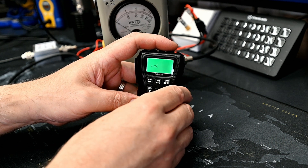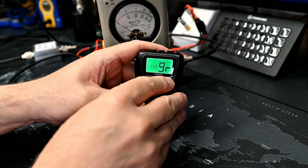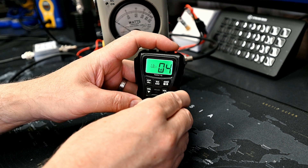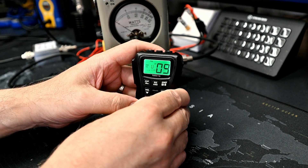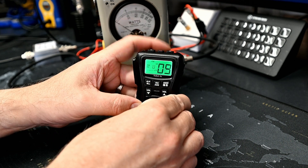AF is the button used to switch between AM, FM and FM UK. To access the menu system, push and hold the EMG button, then use channel up/down to move between menu options. Menu options include: key beep, roger beep with six levels, mic gain control, scan, VOX sensitivity, VOX delay time, RF gain, timeout timer, high-cut filter, TX and RX noise reduction level settings, CTCSS, and reset. It's a simple radio to use, though it takes a little getting used to when to use volume up/down versus channel up/down.